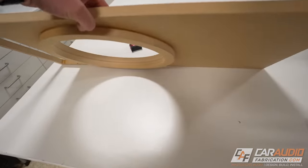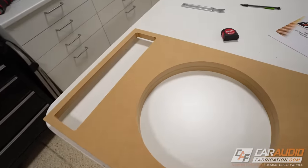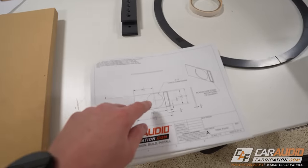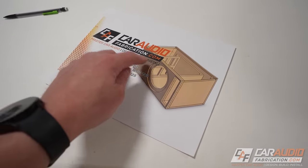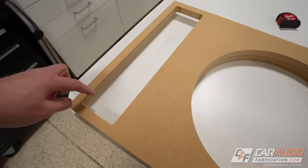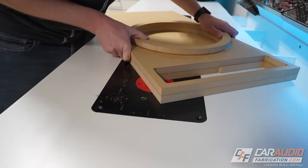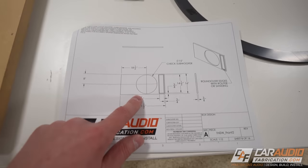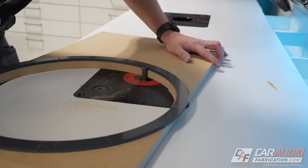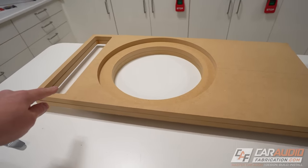Here is our first baffle piece now complete, along with that additional backing ring to give us a little bit more material to bite into for those screws. Having this first baffle complete means when we go to make the second piece — the one on the outside of the enclosure — we can use this hole and flush trim it on the router to our secondary piece. The only difference is that second baffle piece needs a larger hole, going with that larger template size, since it goes around the outside diameter of the subwoofer.